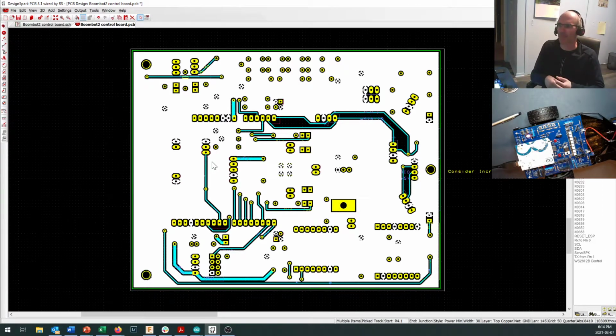We don't do it in a lot of the boards that we manufacture in class because we use a toner transfer technique that doesn't do a good job of filling in solid areas. But when you get a commercially made board done, you can learn a little bit more about copper pours, and here you go. You can have lots of copper on the bottom to transfer things around.